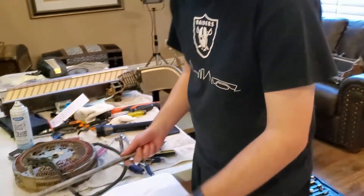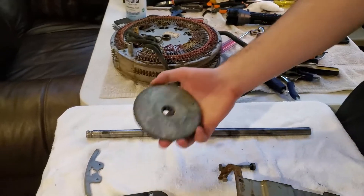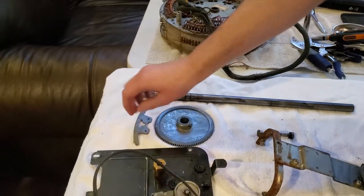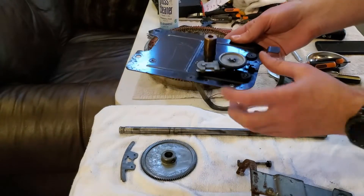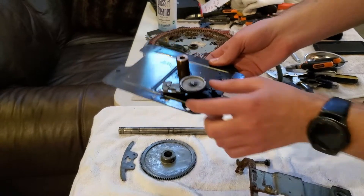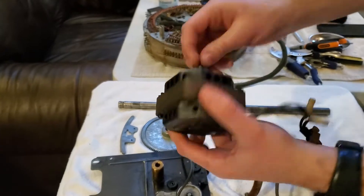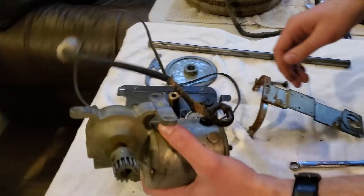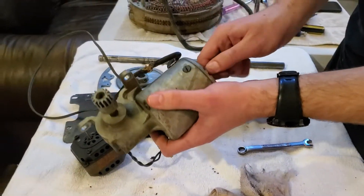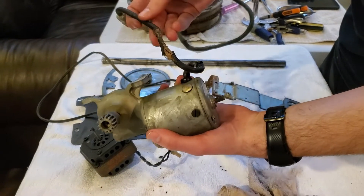Alright, so we got that out. I cleaned up the shaft from the last video — the selector unit — and I cleaned this gear. This is the turntable plate, which is what the turntable sits on. The turntable motor shaft goes through here. I got this motor out — the turntable motor — and it probably just needs a little oil; it spins freely so that one's fine. But this other motor for the mechanism is totally solid and all gummed up.